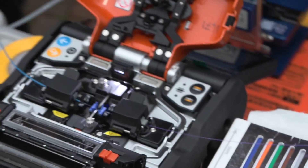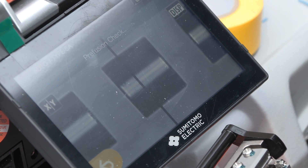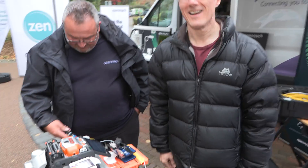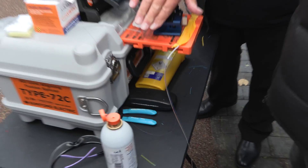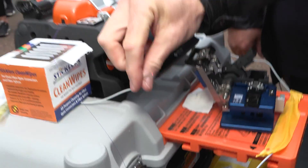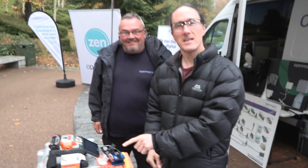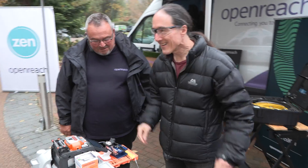Excellent. Shut the lid and you should see your fibres on the screen. There's a bit of muck on there but it doesn't matter — press the blue button. And there we go — look at that, it's arcing them together. 0.01 — almost perfect. And the proof in the pudding: I'm putting some light down that, and you should see light coming out the end of the fibre. There's your connection — that's 1.8 gigabits per second. Well done, excellent!